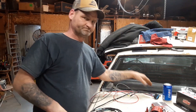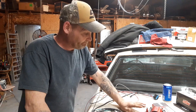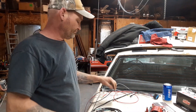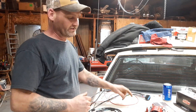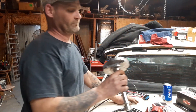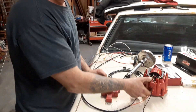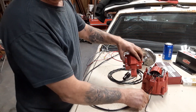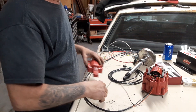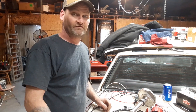If you have any questions you can email me or comment below. All this box is for is a hotter spark — there's no adjustment on it, no timing. I'm sure there are resistors that can be placed inside, like on a Ford, that help cut it off, but you've got to know your wiring. Remember: ground is the common one and goes to C, power goes to B for battery, and the ground wire grounds to your engine. This is brother Chad, GCB — Gangster Custom Builds. I hope this helped you out. Like and subscribe.